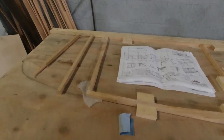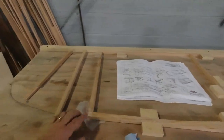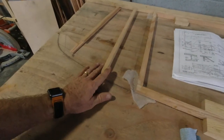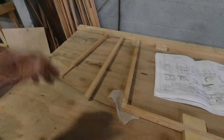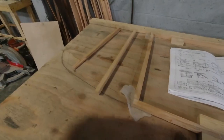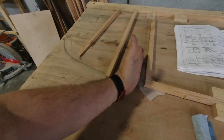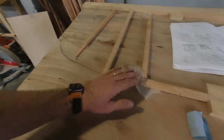And then we'll do the plywood on both, because what I have to do is put the plywood, not glue it, but sort of attach it to the side here, and let it overhang this front section so that I can then build the frame for the front section, and then I can mark out the plywood and then take it back off and cut it to the right shape and leave that eighth inch gap here, and then start the RS9 members, the 3/4 by 3/4 members going this way. And that'll put me in good shape for that.